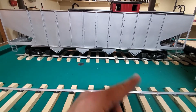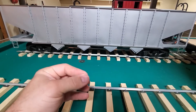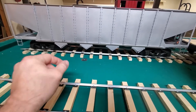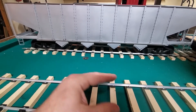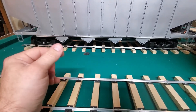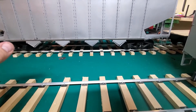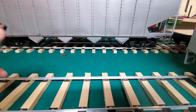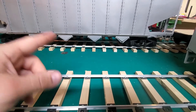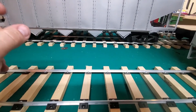Through the joys of YouTube University, I programmed an app to be a Bluetooth remote control on my phone to open and close those doors. I didn't want to use a radio because I wanted open/close functionality for four channels. Most radios self-center, and a single action from one end to the other - neutral would be half open - doesn't suit what I need. I need an open/close switch. I had an Arduino sitting around, a Bluetooth board, and I'd done some app programming before, so I customized an app for the hopper doors to run four different channels via Bluetooth.